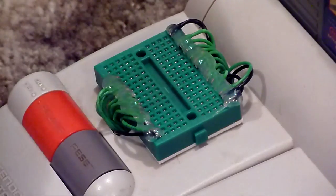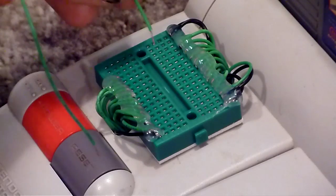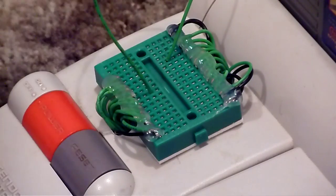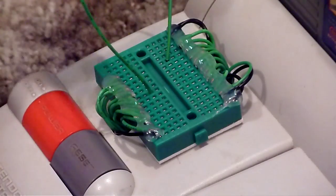Using this miniature redboard, you can take some solid core wire and jump any one of these 30 solder points for a custom video bend. When you use more than one wire, there are potentially limitless video combinations. It doesn't affect the audio.